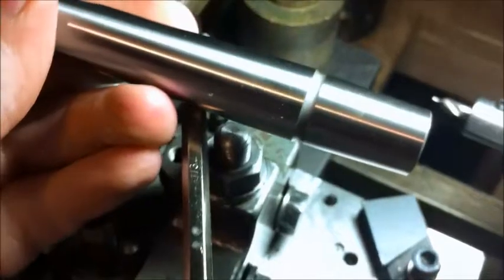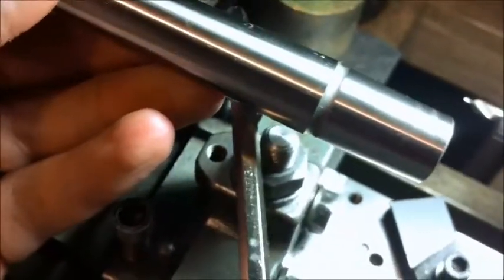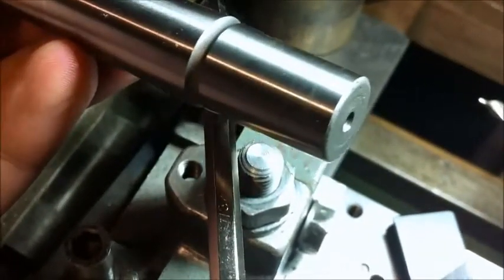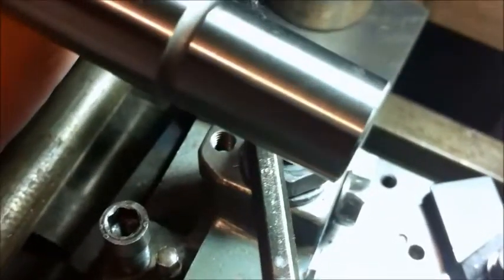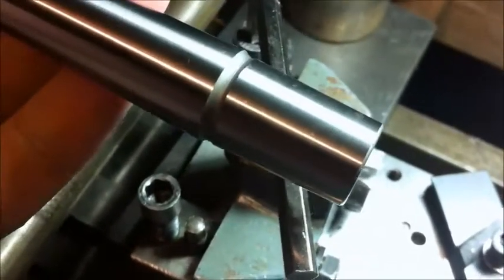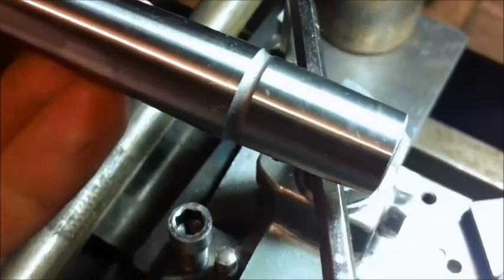What I've got is this cheap drill taper — just an arbor with a J6 on that end and a morse taper on the other end. We're not going to try and turn that down or anything stupid because I bet it's hard, but we will use it to copy. We'll turn it between centres, set the cross slide and compound slide up, and make a taper to match.